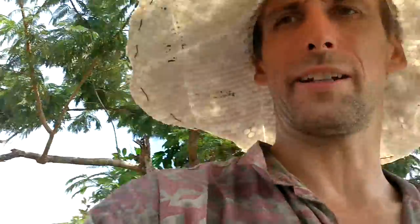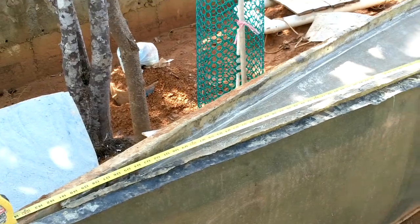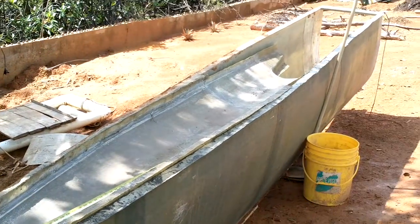This is gonna be good — I could make this right now, but no, don't rush it. I don't want to mess it up. I think I want to get some color for my resin — I don't like doing just clear resin because it doesn't last in the sun. If I put a bunch of color tint in it, it lasts so much longer. But to go to town I need the new boat. I'm so tempted to just slap some fiberglass in there and make the middle pontoon right now, but I want to do a really, really good job on this one.